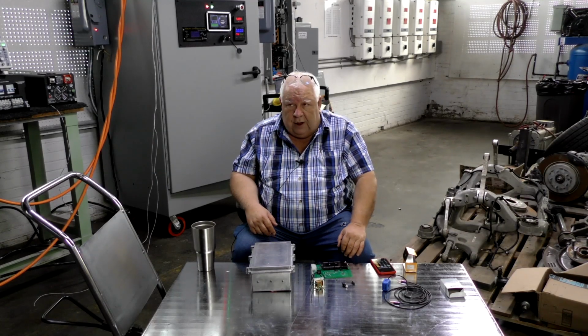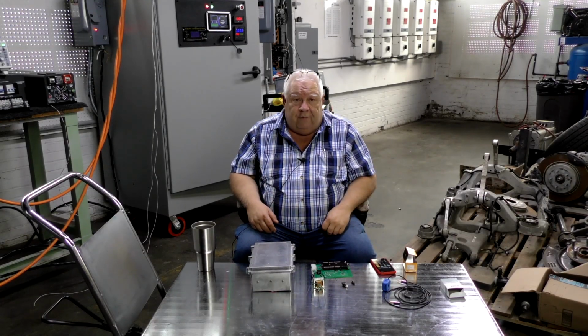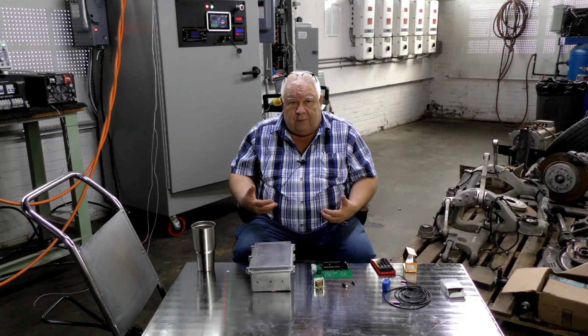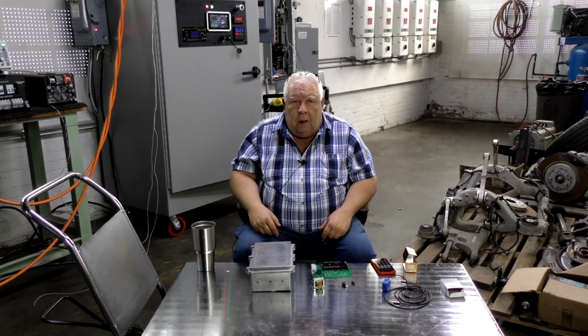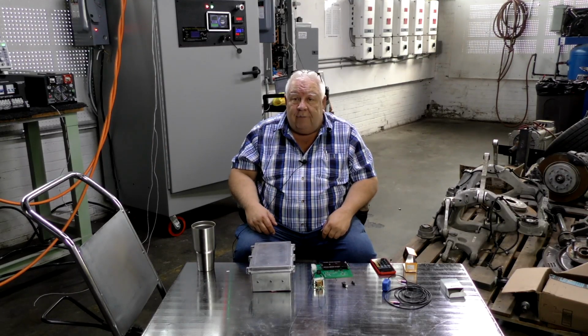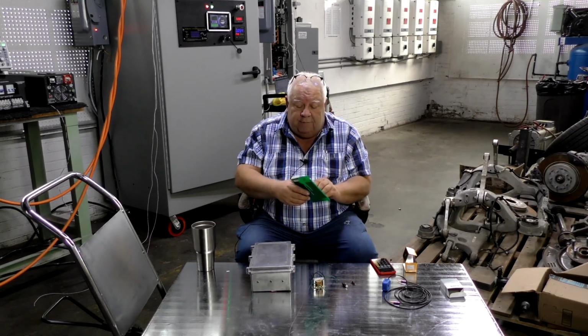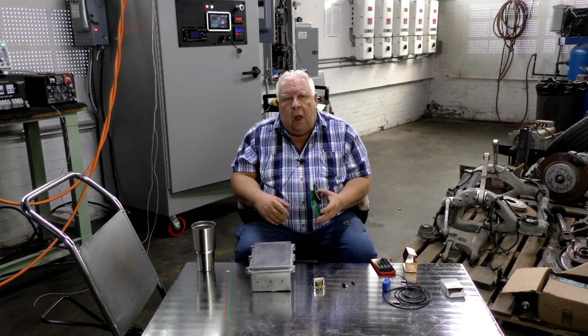And putting signs on things is kind of a 50-50 shot. I always use positive values because I see the world as a battery, and my relationship is as a battery to the rest of the world. A positive value would be in to the battery. That would be like solar production. And a negative value would be a flow out of the battery. We're subtracting power from the battery. From the battery's perspective, that would be a negative, a discharge. And so we'll call that negative. And we can put a sign on power flows of AC power.